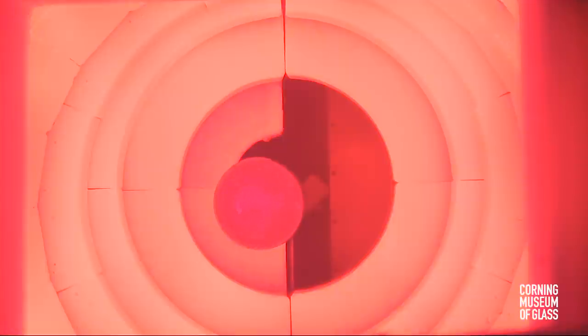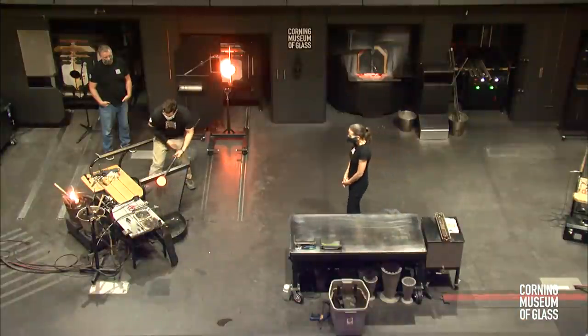So as we layer up these layers of glass, since he's using a newspaper, he's using wooden blocks, there's other tools that are being implemented here that could leave just a little bit of ash on the surface. So we often, if we're not even reshaping too much, we'll go for a quick flash of heat just to kind of burn off any of that residual surface. That way, as we go gathering up these layers, we don't really see the layers. Sometimes you can leave a little haze in between the layers if you're not careful about burning off some of that surface.